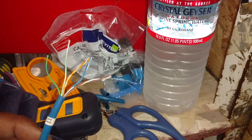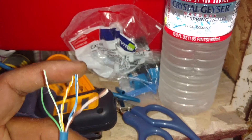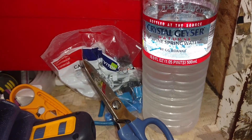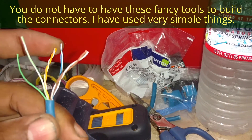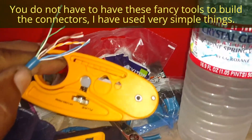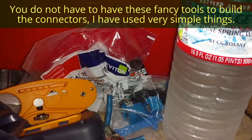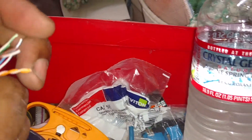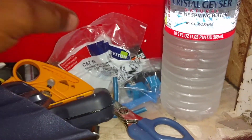The camera I'm working on is number 11. You get your clean cut on the Cat5 cable. I have these kits here — these heavy-duty scissors. Then I splice off about an inch and a half of the coating. I use this tool here; it has that little opening. You put that in there, you spin it around, and it opens up like a clam.